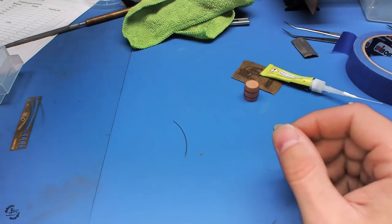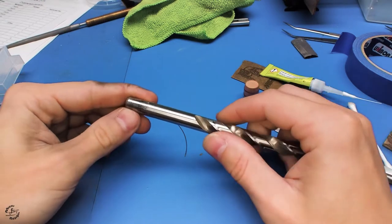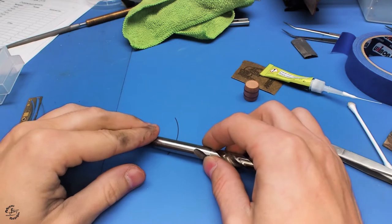The rim is curved for a better match to the barrel body. In order not to bend it directly on the barrel, I bend it using a 10 drill bit, and the rim by itself gets the necessary shape.